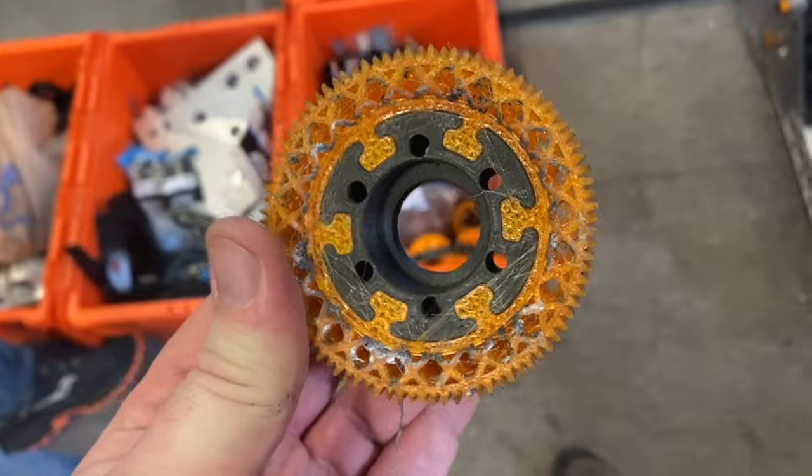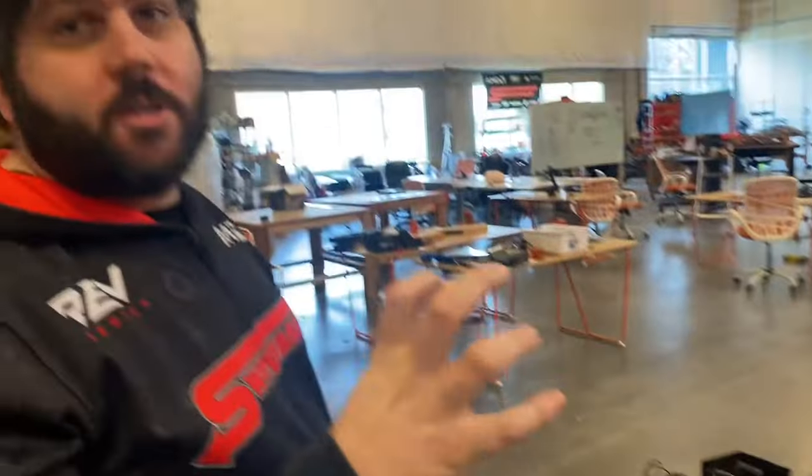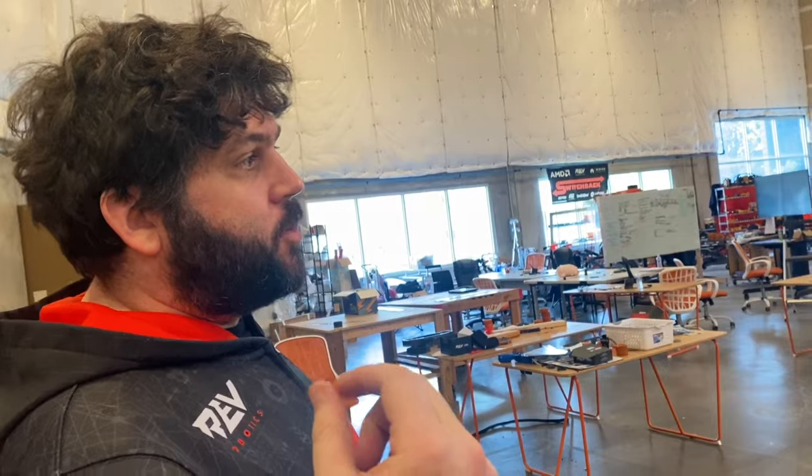Like there's always a thing that people are reaching for. Swerve was that thing, and now more than three quarters of FRC teams are running Swerve. So now the teams that want to go that next little bit are doing these high traction TPU tires, because they can get from about 1.1 coefficient of friction to about 1.6, which is huge. It changes your acceleration. And in a game like this, where you're just cycling, if you can accelerate faster, you can get more cycles in the same match.